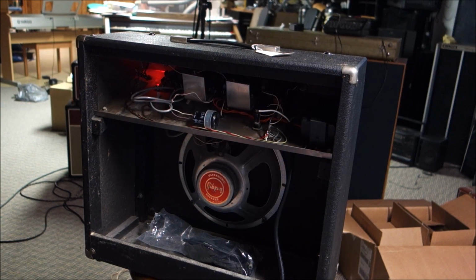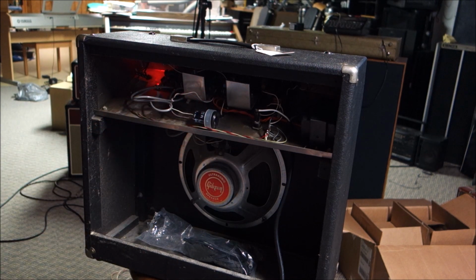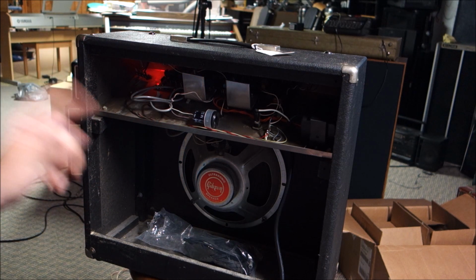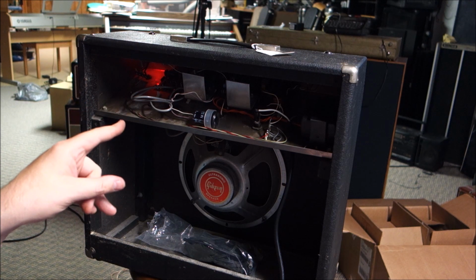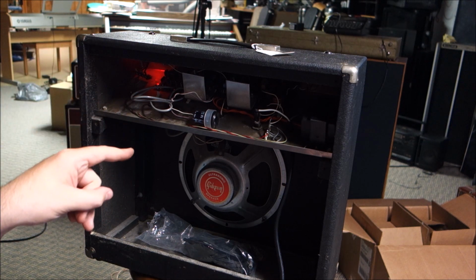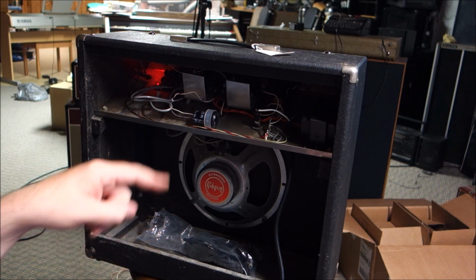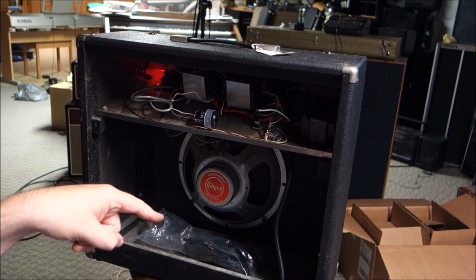Okay, I found it. It wasn't anything that we did internally on this amplifier. The amplifier itself did not make a bunch of noise when A, the death cap was in there, and B, the ground did not exist. Applying the earth ground caused the noise to increase.